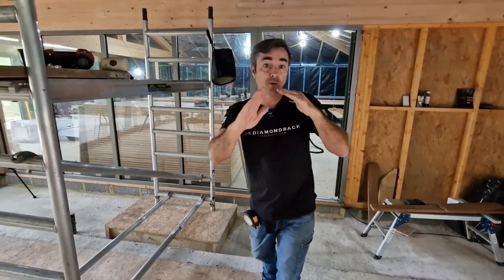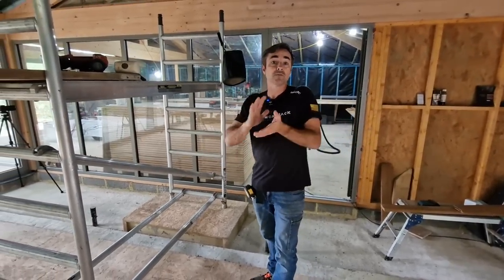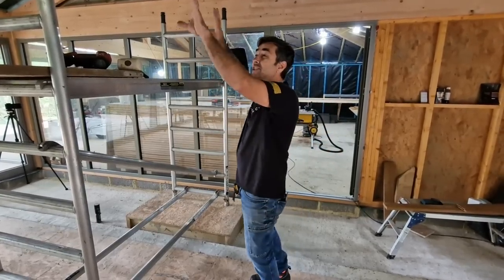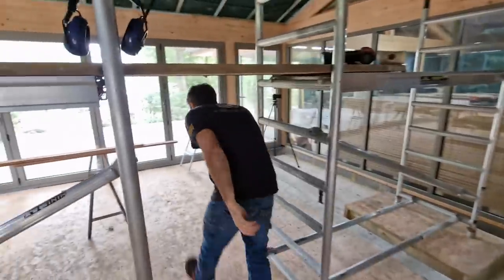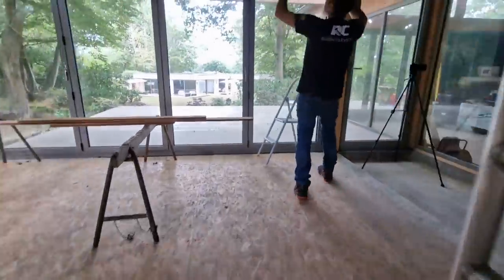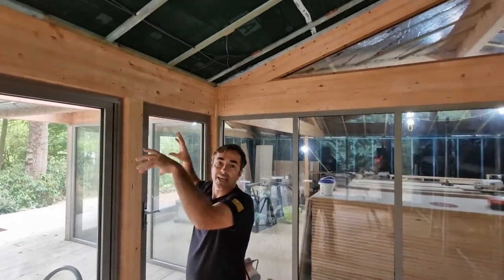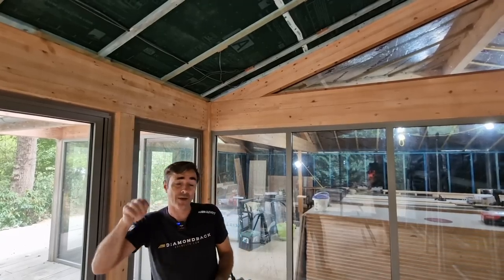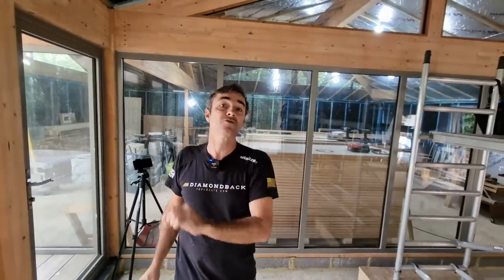Sometimes the tongues have a little bit of defect on them, which is absolutely normal. So when you push them together, you might push one too tight and everything else runs out. So we're gonna crack on now, finish the entire front right down to the bottom. When we get to the bottom, we are going to leave the bottom two courses held with trim screws for now, because when we get the electrical fittings here, we'll take those out, we'll bring the cables through exactly where we need them, and then we'll put them back and possibly still fix those with a very tiny headed trim screw.